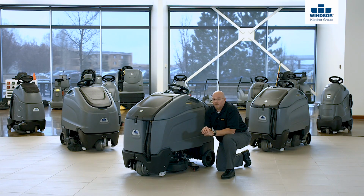And one final thing, our patented Aquamizer system, the squeegees that are located right behind the brushes. This is a system that helps extend the runtime by using water and detergent more effectively and efficiently. Essentially, those two brushes create a cleaning chamber along with the rest of the shroud that holds the water and detergent in and slowly releases it, meaning that you don't have to put as much water down as you would with a conventional scrubber. So the Aquamizer system is really a key component in helping you get the most out of the labor hours that you put in to scrubbing your facility.